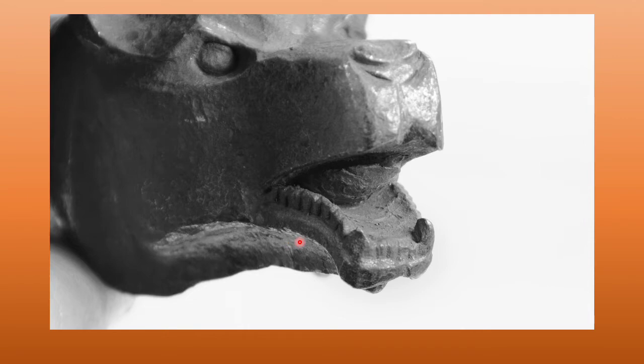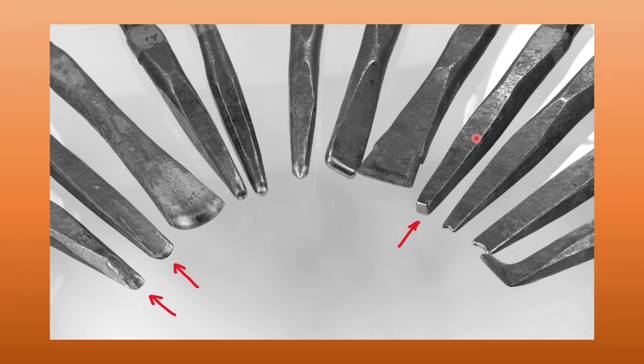The other thing we've got to do now is make the nose, or what I'm going to call the nose. A bear has a strong sense of smell and as such the nose dominates that snout area. We're going to use three tools for the nose: the 5/8 curved chisel which we used to make the tongue, something that will be about a quarter inch ID that will be used to flare the nostrils, and then we're going to use the side set.